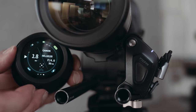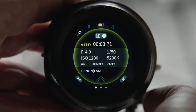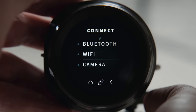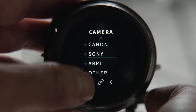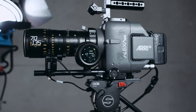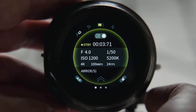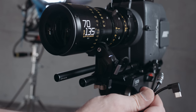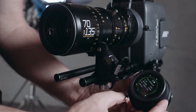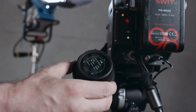If you have the Nano 2 connected to your camera, the camera control screen should deliver an overview of basic settings like F-stop, ISO, shooting mode, and give you run-stop functionality. At time of this review, Canon, Sony, and ARRI cameras are supported via a variety of protocols, and Panasonic support is on the way. I have an old ARRI XTM here which doesn't communicate settings via Wi-Fi or USB-C, so no settings are displayed. But with an additional Fischer 3-pin to USB-C cable that Tilta supplies, you can trigger recording via RS protocol — and that alone is worth the price of the Nano 2 for me. There is simply no other cost-efficient way to remotely trigger recording on older Alexas.